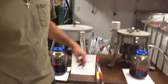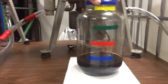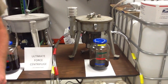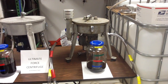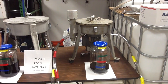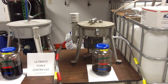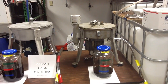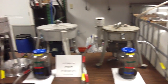This unit here holds just a little over 2 cups — that's all the bowl holds. The time in the bowl is roughly 45 seconds. Even spinning at 6,000 RPM, this is probably not going to have the cleaning power of something spinning at 3,450–3,600 RPM with a larger bowl. On this one, the bowl width is 7.5 inches, bowl depth is 2 inches, and the lip on this one is 1 inch.